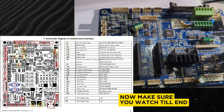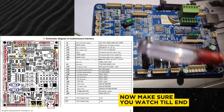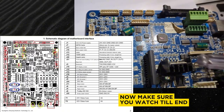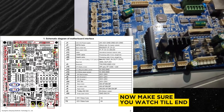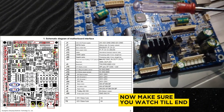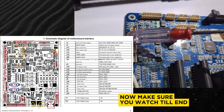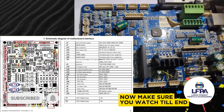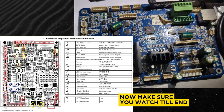That's pretty much it. For a comprehensive guide you can follow the data sheet shown on your screen — all of what I'm doing is just so you can know what to quickly look at when someone mentions the driver board. These are also first aid things you can do to check whether it's your driver board that is bad. If somebody tells you your screen is not lighting up, you know to look at J19. If the motor is not working, check the DC motor. Board not lighting up — check power and fuses. Network issue — check the network port. Fan issue — check J24. Getting familiar with this board will definitely go a long way. I hope this has helped — hit the subscribe button, hit the like button, turn on the notification bell, and I'll see you in another video.